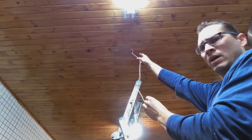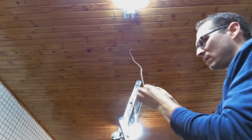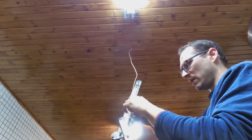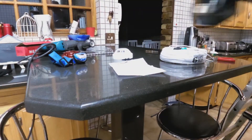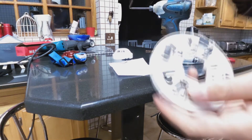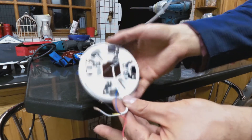Push the wire through in the ceiling — that's going to the other side, which is at the alarm center. Now I'm just going to strip the wire. This happens to be a six-core wire and you need four cores: live, positive, negative, and then the signal wire — in my case I'll be using blue and white. This is going through the ceiling so the wire has to go through the unit before you wire it up.